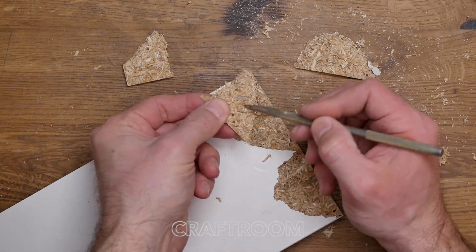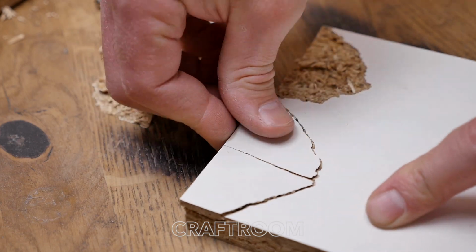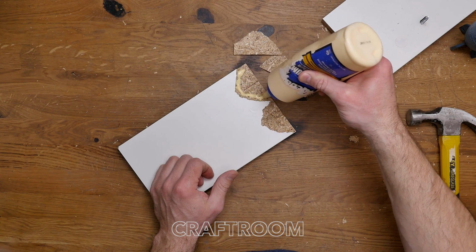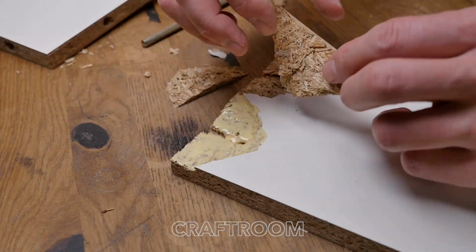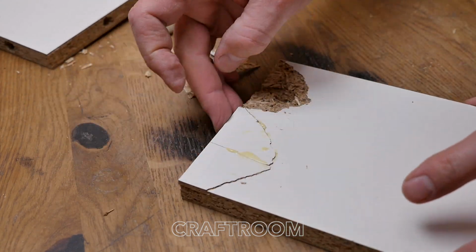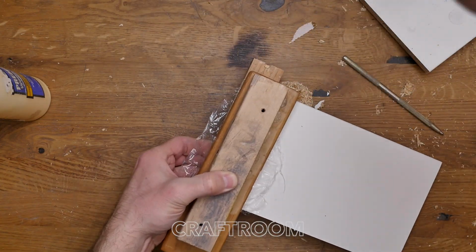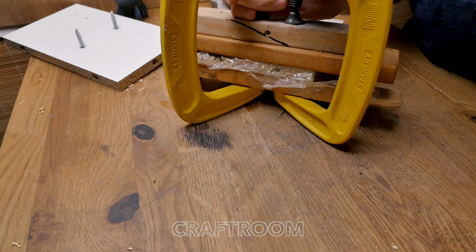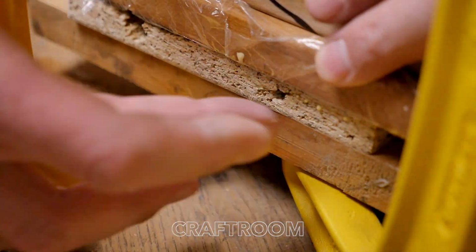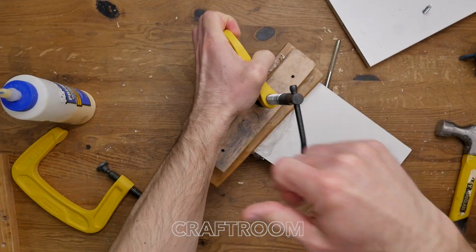We clear the space of breakage from garbage to do this. Now we will try to put everything in place, as tight as possible. Next, we use PVA adhesive. And we fasten everything with clamps. The most important thing here is to clamp everything as tight as possible. We leave it to dry. We disassemble it in a day.